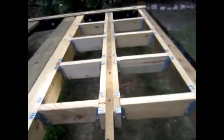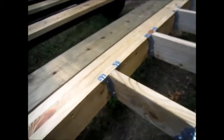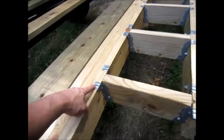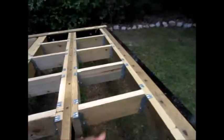On the porch deck framing, we've got these ledger boards that we've attached, because these framing connectors — these joist hangers — need those boards to attach to. They need to be able to attach to something that's made from wood. We also made sure to use hot-dip galvanized fasteners and the joist hangers are triple galvanized, because all of this is going to be exposed to the weather.